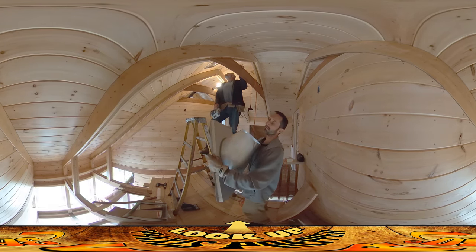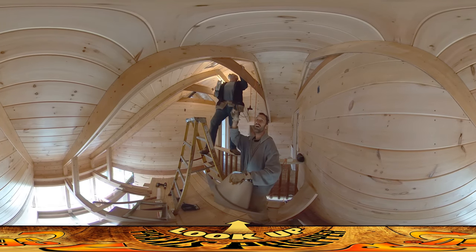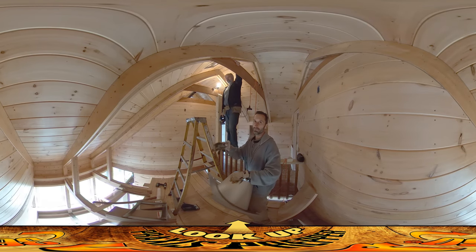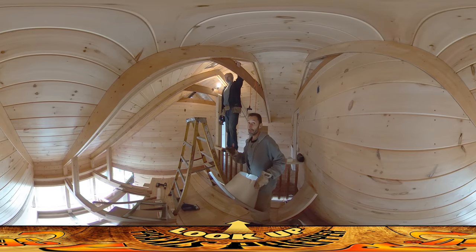As of this morning, this didn't have any of these metal bends on the side, but we were able to determine that we could put this so the center of the chimney was in the valley between a couple of the ribs. The other option would be that it was positioned directly on top of one of the ribs. Down here we can only get so close to these roof rafters, and obviously the placement of the chimney stack influences where the wood stove is below.